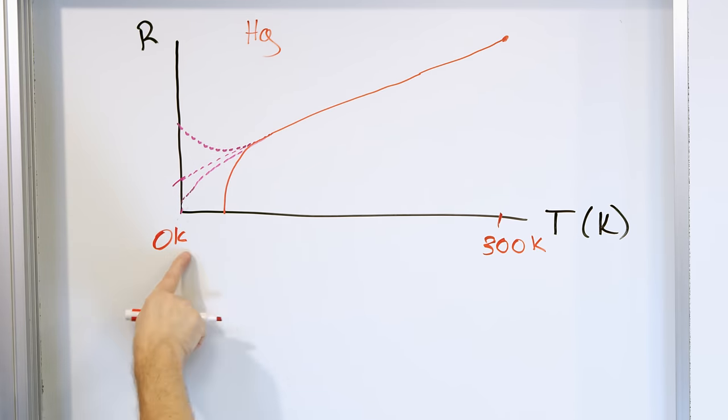And these positive charges and also these negative electrons, they're jiggling everywhere at room temperature. Everything's violently moving everywhere at room temperature. And so these things are scattered everywhere mostly off of other electrons that are in this. But as a group, even though they're bouncing off of each other, they're still kind of making their way over this direction. And that's what we call electric current flow. But there's a lot of losses because every time it collides with another electron or something else in the way, it loses a little energy. Now we have a battery connected, which is always putting energy in and fresh electrons. And so the process can continue, but we're losing energy.